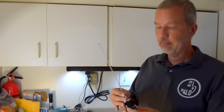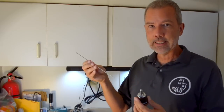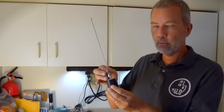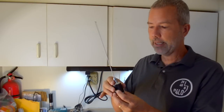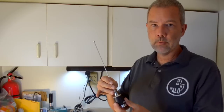Now a UHF antenna — most UHF or GMRS antennas don't have that nifty little feature that lets you easily lengthen and shorten the antenna. Most of them have a little bit of give in the base that will allow you to move it up and down and increase or decrease the electrical length a little bit, but most of them you have to trim quite a bit from when you take it out of the package to make sure that it's properly tuned.